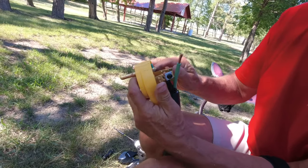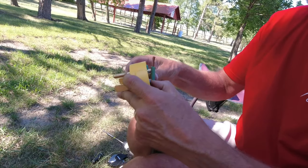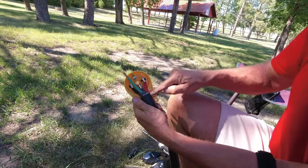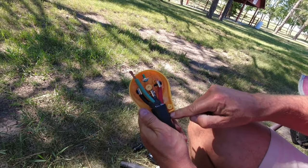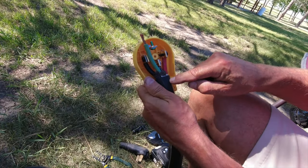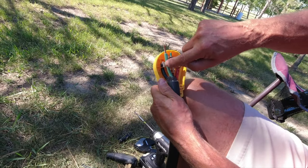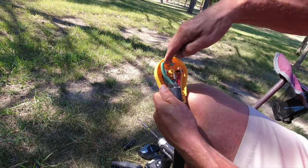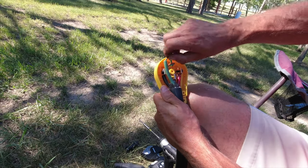I line up all the terminals right here, use my knee as a second hand, and then we just slide these into place. There are no loose strands — it's all nice and secure. There's enough of the black rubber sheath inside the strain relief clamp so there won't be any movement. See how the grounding wire comes in over the white and the black.